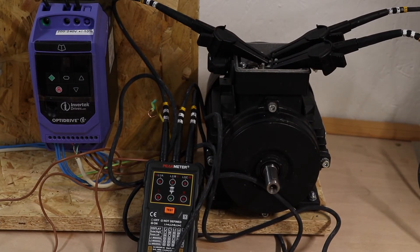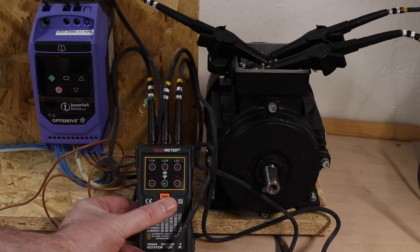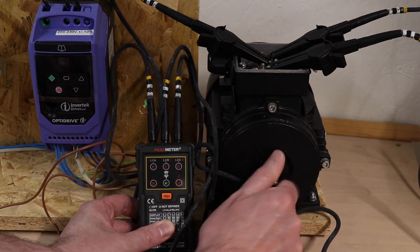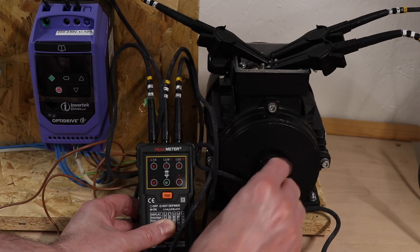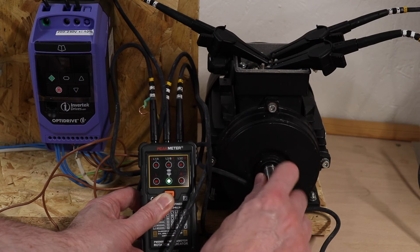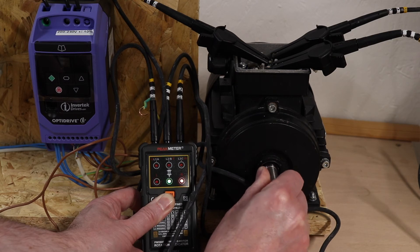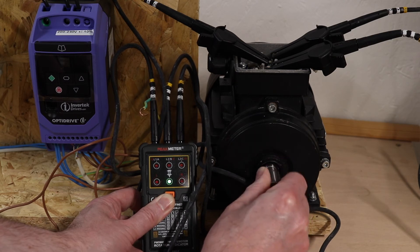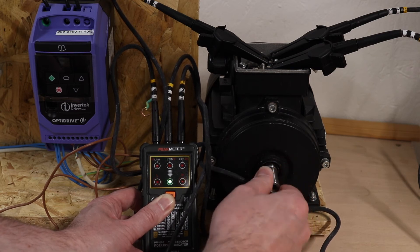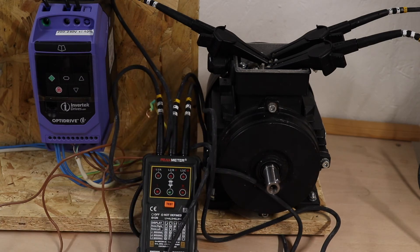Reconfiguring for the motor winding rotation test. The Peak meter connected to the motor checks direction depending on winding connection. If you spin the motor you get no response — you have to hold the test button in and then flick the motor. It's actually quite sensitive; a quarter turn gets a reading. Going back the other way shows left rotation. Seems to work fine, quite sensitive.